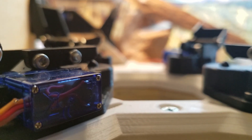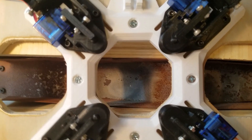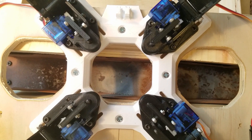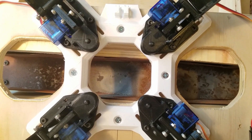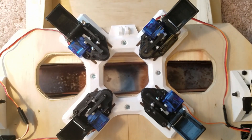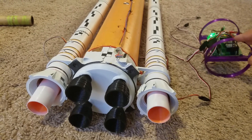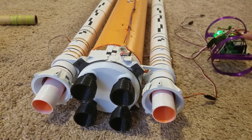For my flight, I think the main issue was in the hold-downs. The vehicle rests on the pad with the boosters supported by outboard riser plates. The risers just kind of support the boosters and keep them from falling off while it's on the launch pad. But the launch clamps are supposed to actually retain the rocket under thrust. There's only four of them, so they can't actually withstand too much load. The core engine is the only engine they're intended to hold back — they cannot withstand the full stack — but I'm pretty sure during the flight that's exactly what happened.